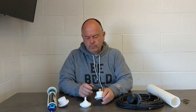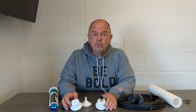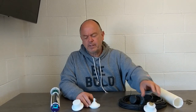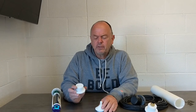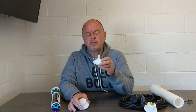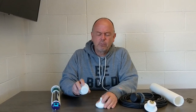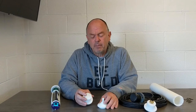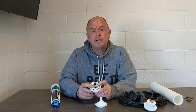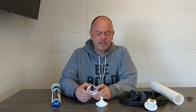And here you go. So you have several options of hydrophones available to you, and they break fundamentally into two categories. One is the endcap integrated type, of which you see two here. This one is for operation up to 33 kilohertz. It's called the SH33. This one is for operation of up to 125 kilohertz, called the SH125. And they are very rugged devices. You will not easily damage them. And they are also programmable. Their sensitivity and frequency response are programmable through solder jumpers that you see here on the inside.